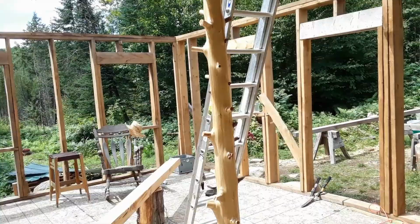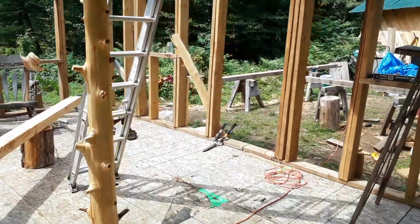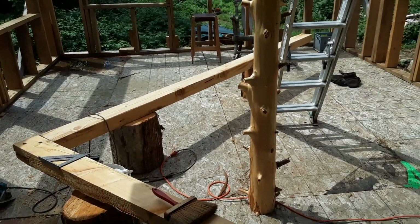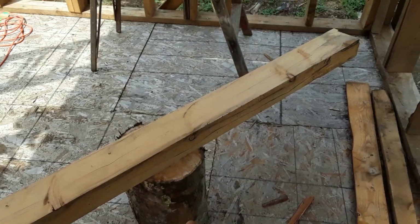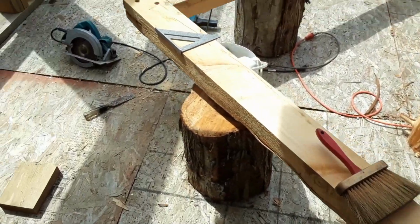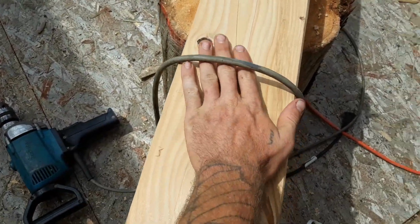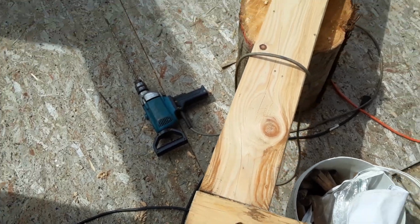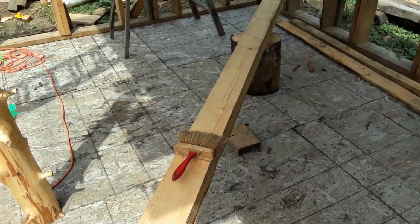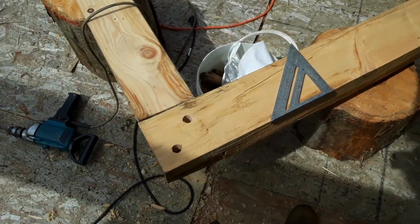We really like this nubby support pole too. And another thing I wanted to show you is we're working on our rafters. So I've got to make some bird's mouth cuts down here, but we have some of these lap cuts done, and Shikoi planed them and sanded them, and they look beautiful. So these two, I believe, are pine, but we also have hemlock rafters and then some old barn beam 4x6s that we're going to use.